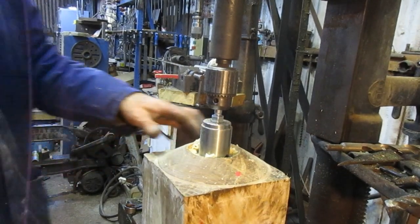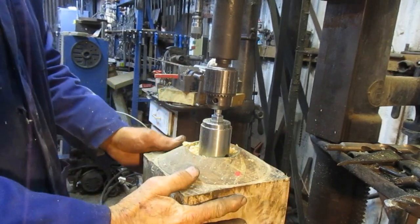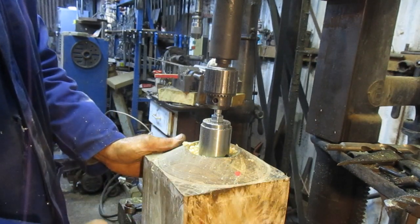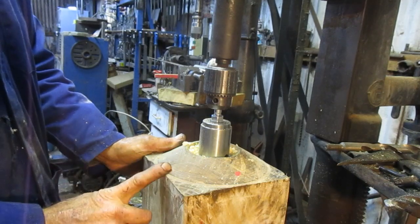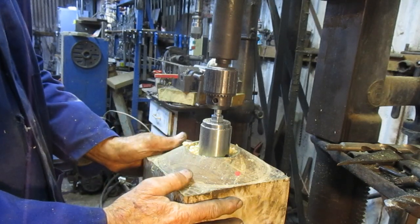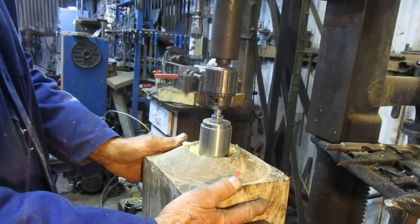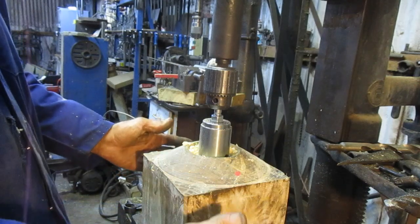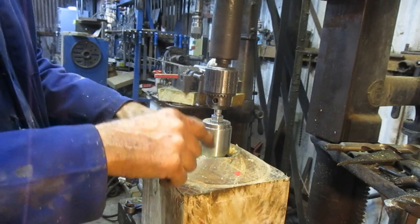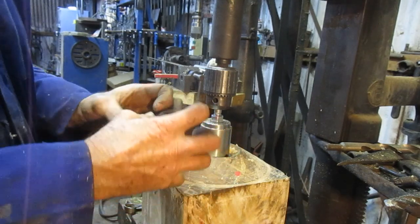This is the neck bearing of La Cotte mill. This is going to be set into the bedstone and the stone spindle will pass through it. Now, what's happened in the last couple of months is that the wood has shrunk, and where it was very tight in the neck, in the square of the bedstone, it's now relatively loose. So we're going to glue it in, and I'm going to put in a phosphor bronze bush in here because it's also shrunk onto the shaft.